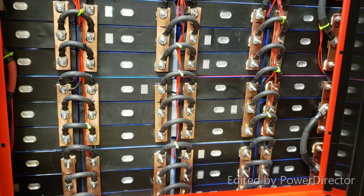Okay? So just because cells appear to have the same voltage doesn't mean that they are on the same level of charge. That's how the majority of balancers work. I don't care which one. It can be a Batrium too. It still works on voltage, but it does not know what the state of charge of that battery is. It might show up, as we saw in the beginning, at 3.35 volts on the majority of those cells, but then one cell reached 3.75 in like 1 minute. It might be misleading, just checking the voltage on the batteries. You need to see the true level of charge.